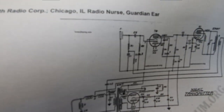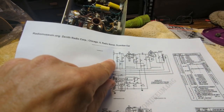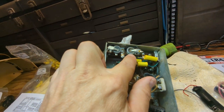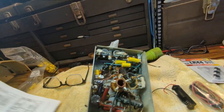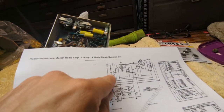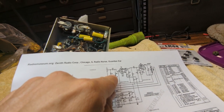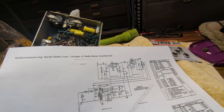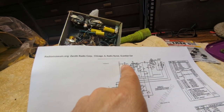And you can see here, this is where they are in the schematic. And it's key to pay attention here, because both positives go to chassis ground. And the negative, interestingly enough, go to the microphone. And one of them goes through a set of resistors here, R1 and R3. R1 is 2.2 mega ohm, R3 is 1 mega ohm. And this number one here, that is the actual microphone.